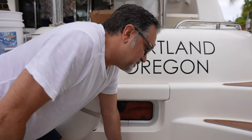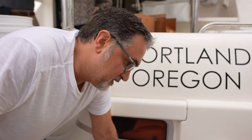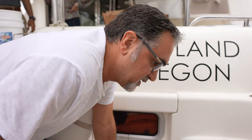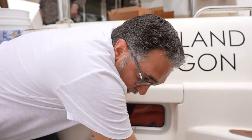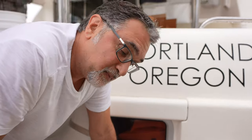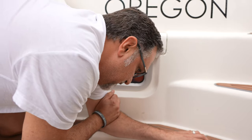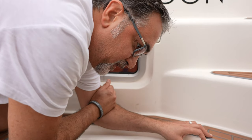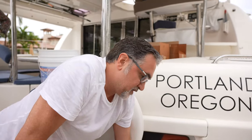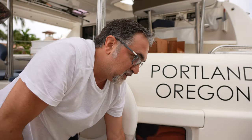Oh yeah. The idea here is you want to disconnect the suction side of your main engine, the sea strainer. It looks like it will be the easiest location. So I take off the hose that's feeding your sea strainer into your raw water pump, and that's going to be your supply side for the Porta Flush Junior. And then the exhaust elbow that's right here, coming right off the heat exchanger, is going to be your return line. So you're basically creating a circulation loop that should flush out all the calcium, with Barnacle Buster, obviously.